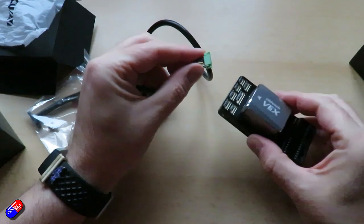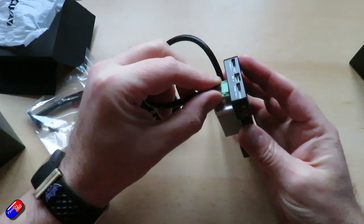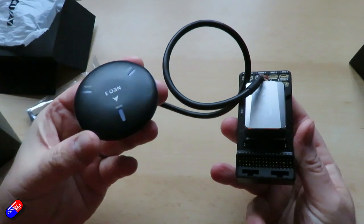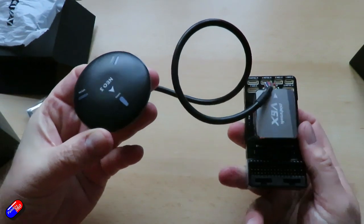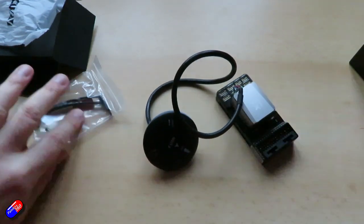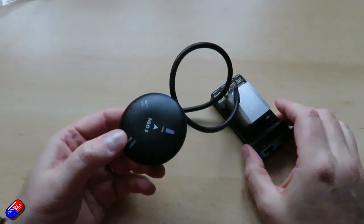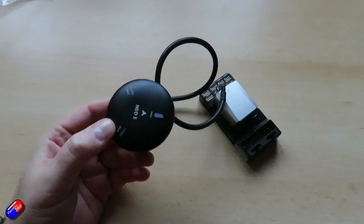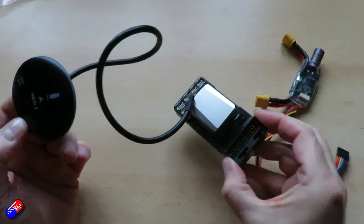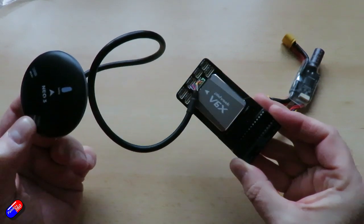So while I have this stuff in, I thought I'd make a quick video to show you what this latest hardware from CUAV looks like. Hopefully it's a little more obvious why you might choose a Pixhawk system over something like a Matec or Omnibus — a lot of it comes down to the high-end processor, the redundant IMUs, the redundant barometers, and the heating. With modern ArduPilot, there have been a lot of changes adding support for CRSF, DJI OSD technology, and all that stuff is now available too.